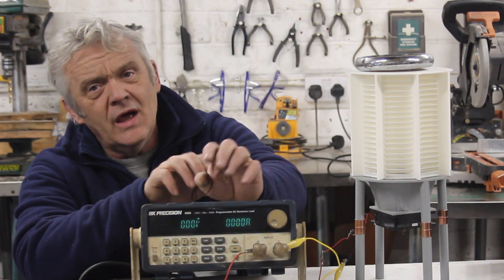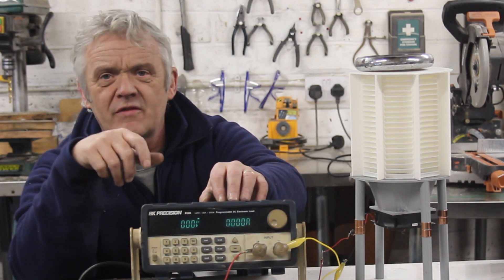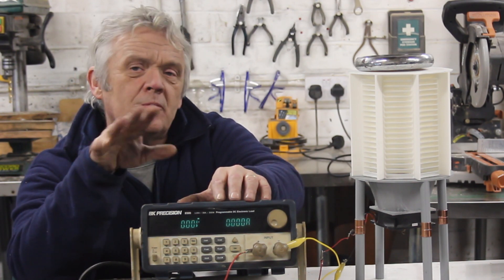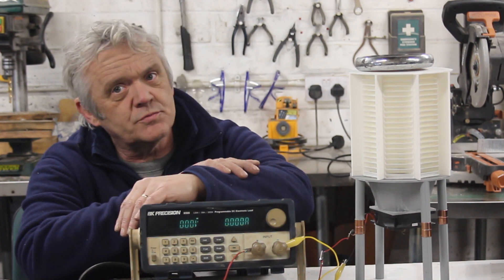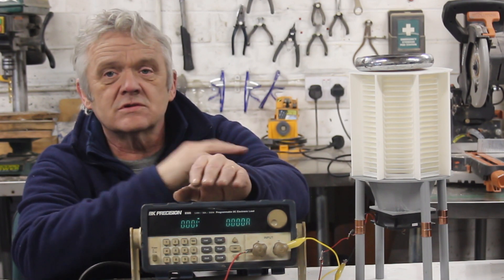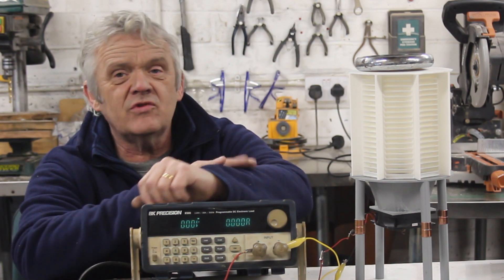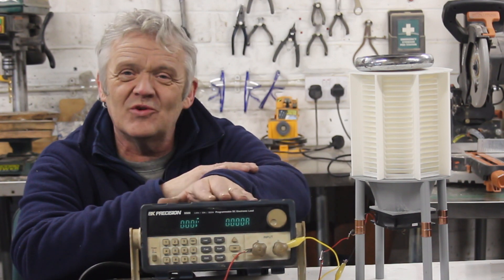Well, relatively stable — as stable as batteries are. It works really well on things like solar cells as well. Now I've never tried it on things like wind turbines, because they're a little variable in their output — you're getting rotation through magnetic fields that vary quite a lot. So it will jump up and down as we read that stuff, but we'll be able to get a pretty good idea of how a generator is performing under a fixed condition like this without pre-stabilising the voltage. We'll just take the top figures of each as a guesstimate, giving us an idea. It's going to be unstable and jumping around, so it will be some kind of average, but we can take that as a best case scenario — just to tell us whether we're in the ballpark or not.